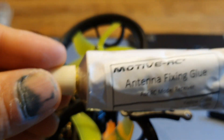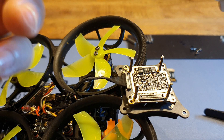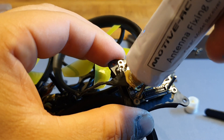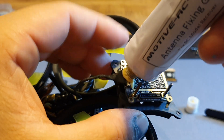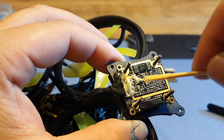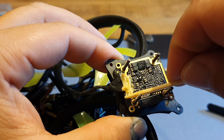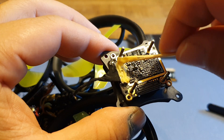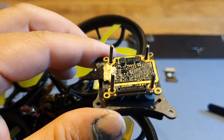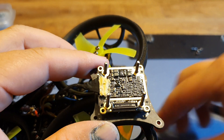To prevent these from popping out in a crash, I use antenna glue. I don't use hot glue because VTXs warm up and if your hot glue warms up, well, you know. I'm being quite liberal with the antenna glue — it's also a good way to keep moisture out. I tend to use enough of it. Okay that's good — it isn't pretty but it's good.